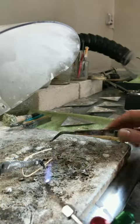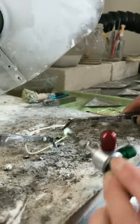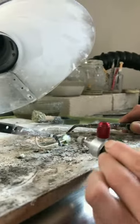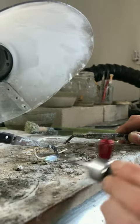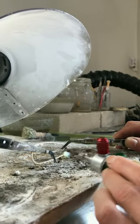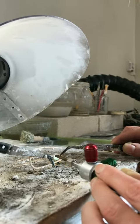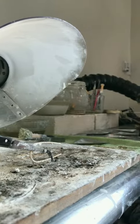We want to make sure that the post is straight up and down. We don't want the solder to jump up onto the post — solder will follow the heat. So the post will just be heated up by the ambient heat. And we're done.